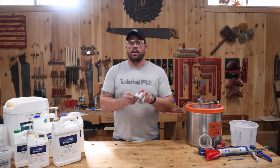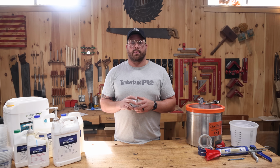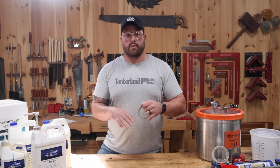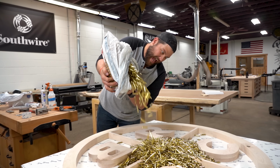And because that one was specifically poured to have an arm hanging down, I couldn't throw it on a flattening jig or do anything like that. And that all happened because of the melamine melting. And we've kind of learned our lesson now, and we cover the bottoms on all of our molds with either Tyvek tape, packing tape, a wide packing tape, or something that isn't just the bare melamine.